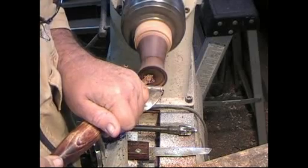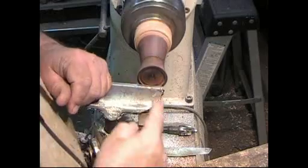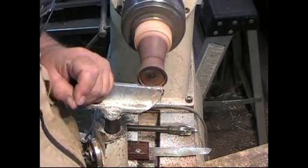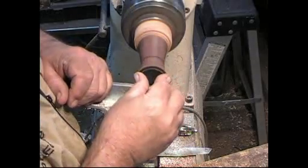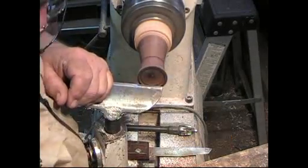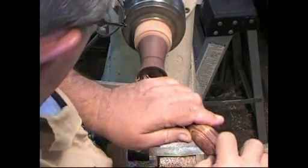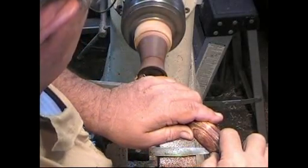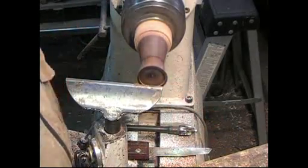So I'm going to go a little bit deeper. And here's a cool one. Before you set the piece, write something on a little piece of cardstock and put it dead in the middle, in case it does pop out, they'll think they found something. And then I know I have to go an eighth of an inch deep on the sides, if I want it to sit flush.